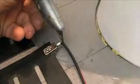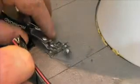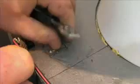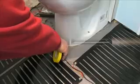As I'm putting a vinyl floor on top of the elements, I want to make things as level as I can. This means channeling out the Capron sheets to accommodate the clips and the cables. Once everything's in place, simply hold the cables down with a suitable electrician's tape. There, nice and neat and tidy.